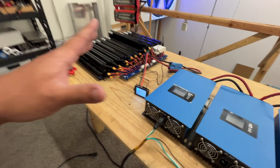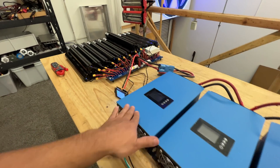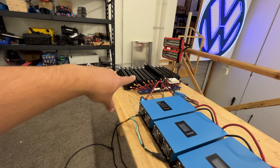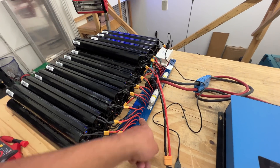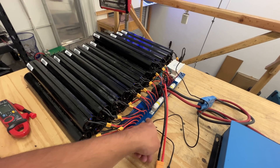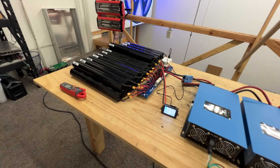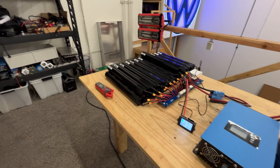What we're going to do tonight is load it at 1C — that's basically one times capacity, so about a 4 kilowatt load. That's what these four inverters are here for. We're going to connect those and start putting all that energy from the batteries back into the grid through these inverters. Then we're going to keep an eye on the temperatures and see how it handles the 1C load. After that, we'll decide if this is good enough to sell as-is, or if we need bigger copper traces or bigger cables. This is the test: continuous 4 kilowatt thermal performance.